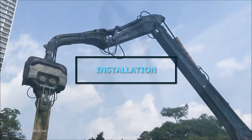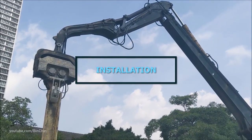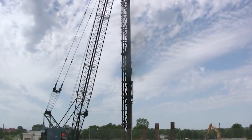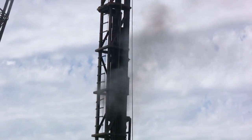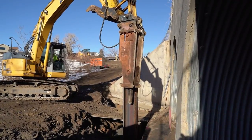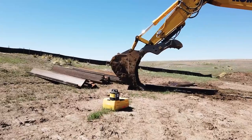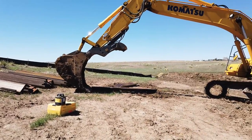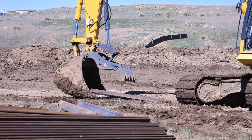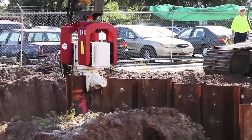There are several ways sheet pile can be installed. For really deep sheet pile installations of 20 feet deep or more, we may see a crane-mounted pile-driving hammer. This size equipment is rarely used on district projects because we don't often install sheet pile deep enough to necessitate it. We more commonly see excavator-mounted equipment such as a vibratory head or a concrete breaker head. If site conditions allow, an excavator bucket can be strong enough to push the sheet pile into the ground. The soils make a big difference — if you're in the eastern to southeastern part of our district where there are sandy soils, an excavator bucket or a vibratory head may work just fine.